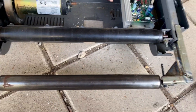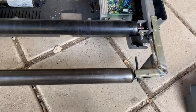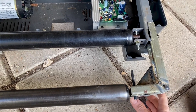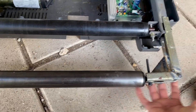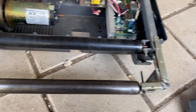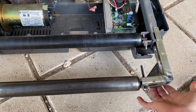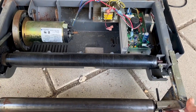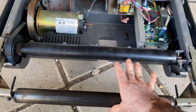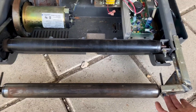If you don't have welding equipment or aren't comfortable with metalwork, there is an option — you can make this L bracket from any kind of hardboard with a little support. I do need support down below; we'll put a concrete block, a 4x4, or something like that. As you can see it's a bit wobbly, and once we put a weight between these two rollers for the ball mill drum it's going to get heavy, so we'll need support down here.